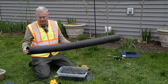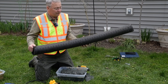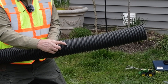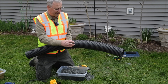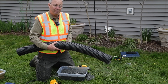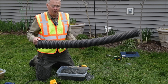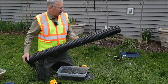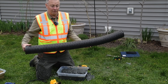This is a modern buried drainage structure — a 4-inch diameter slotted drain pipe. If you look closely, you can see narrow slits. This is buried in the bottom of a ditch dug to drain a wetland. These slits allow groundwater to enter the pipe and flow downhill to the outlet, which is usually another ditch. It's a very effective way of draining wetlands, and I know farmers who are putting in miles of this every year. This buried drainage structure will eliminate standing water from a wetland and also lower the elevation of groundwater.